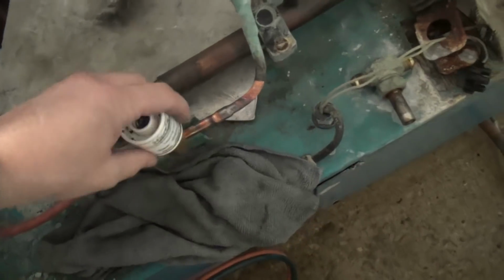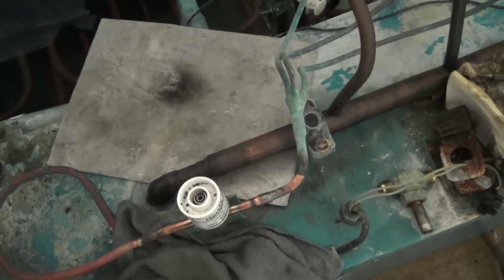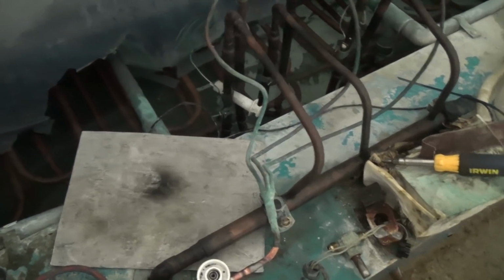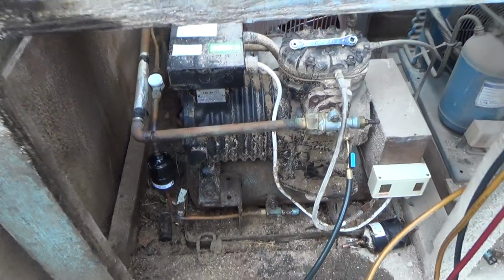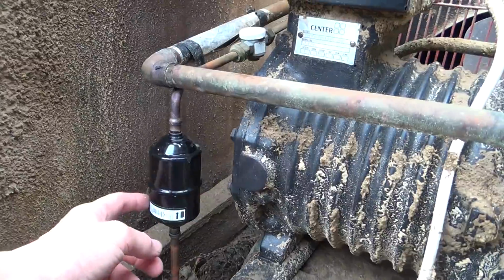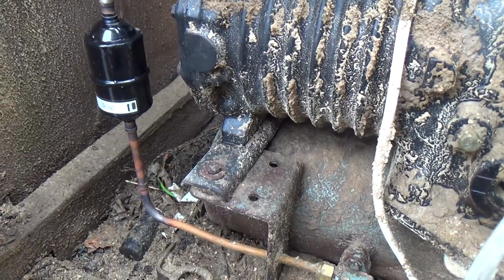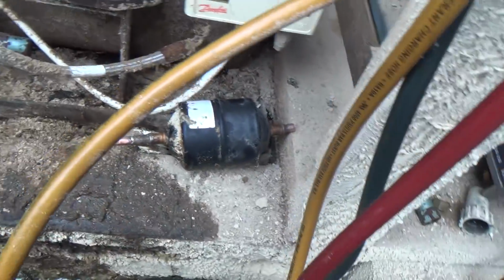Anyway, I think that's good. Go and get the dryer changed, then we can leak test it and vac it out. Well, change that dryer. That was the biggest one I had in there. It's a 083, 8 cubic inch. I usually put 16s on most things, but anyway, that's probably better than the old one. It's been there 10 plus years.